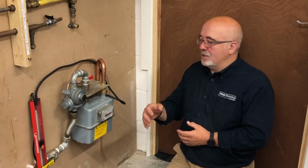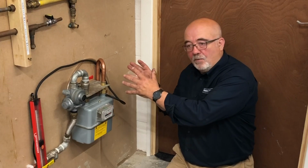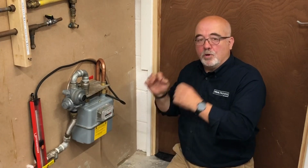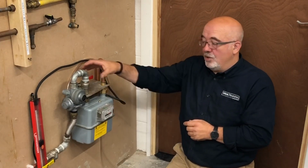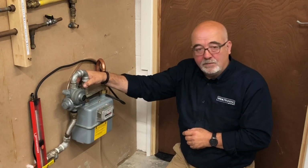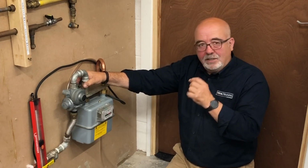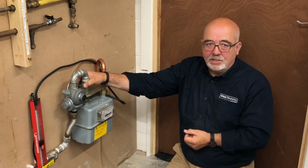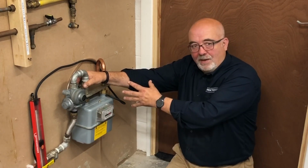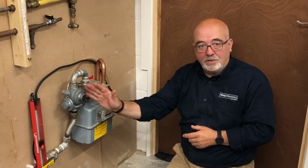And what are you testing at 19 millibar? The 19 millibar test on the little toggle valve here is we're testing the conventional low pressure system, but only if you don't have the additional MIV and meter control valve above the meter. As long as that's connected, and literally 99% of any installation you go to will be, as long as it's got that valve, you can operate everything from that valve. You don't need to depressurise the inlet.